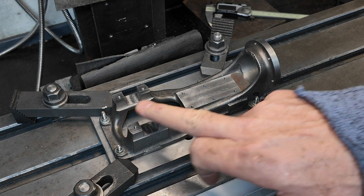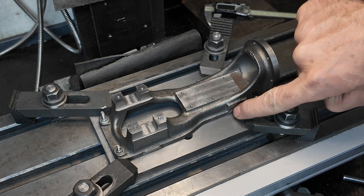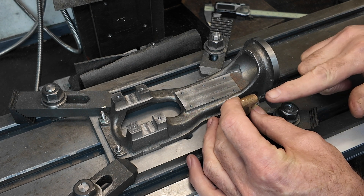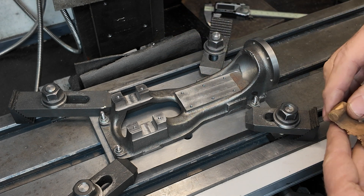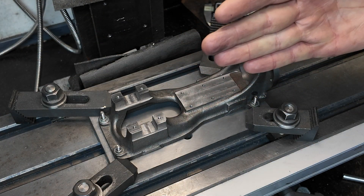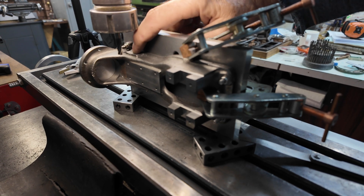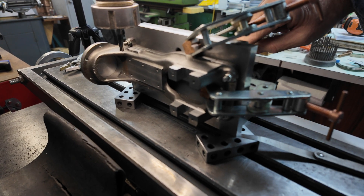All our holes are drilled and all these surfaces are milled. The only things left to do on this sole plate are this mounting surface here — which mounts the arm that holds the valve guide — and there's another one on the other side for a pump. Pretty happy with that, it's looking really good. I'll tear down the fixture and mount it 90 degrees to take down that surface, which is used for a little bracket that will stick out. Okay, that's it for this episode — I'll see you next time, thanks for watching, bye.